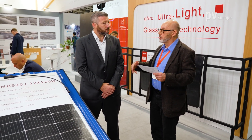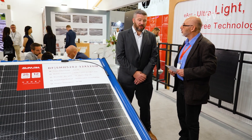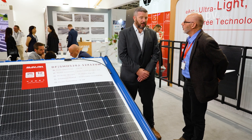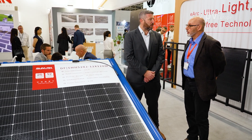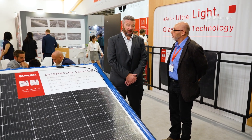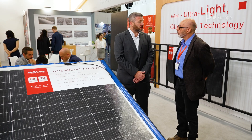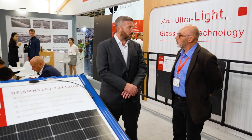In terms of durability, what life expectancy can we have? The solar market is very sophisticated — we have lots of international standards to test to, in particular IEC 61215, where all solar modules have to go through this extended durability test. We've had to pass the same durability tests that glass modules have, so in terms of life expectancy and durability, we're the same as glass modules — but the weight is 70% lighter.